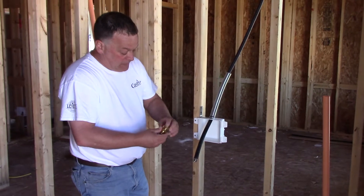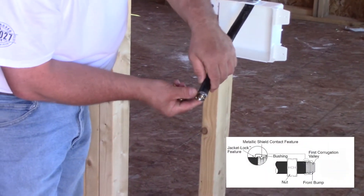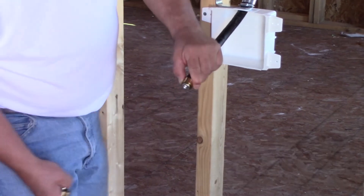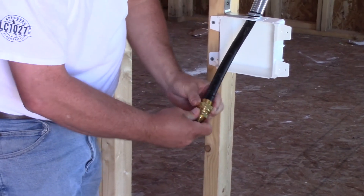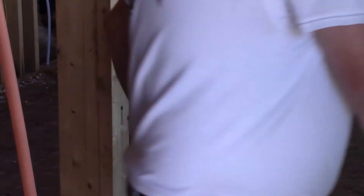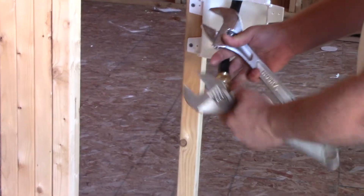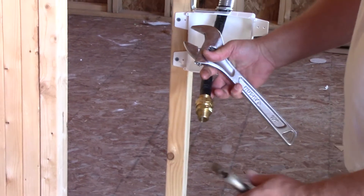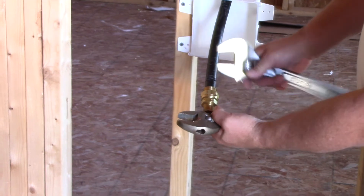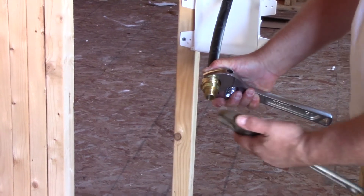Take the fitting, take the nut, and slide the nut up the pipe. Crack the bushings in half — the bushings go on the first valley back. One corrugation is exposed beyond the bottom of the bushing. Pinch the two bushing halves together, slide the fitting body on, bring the nut down, and tighten it up. When tightening the fitting, a key point is that this fitting is not locked in or piped up into a fitting component — it's not rigid, so we're tightening it in the air. We need to hold the fitting body and spin only the nut. If we hold the nut and spin the fitting body, we'll drive that body into the sharp end of the tube and could ruin the fitting.